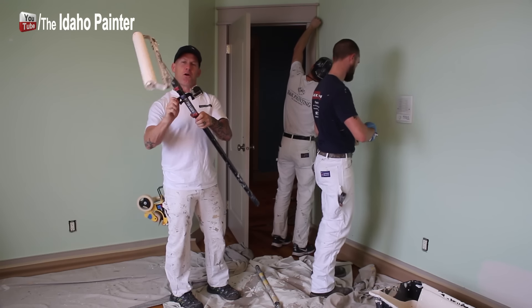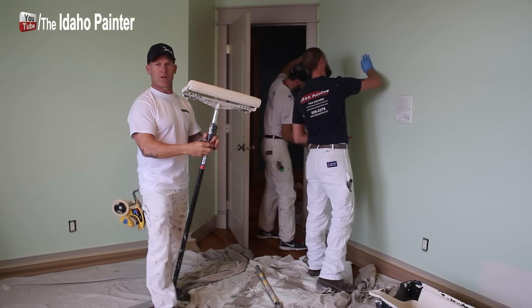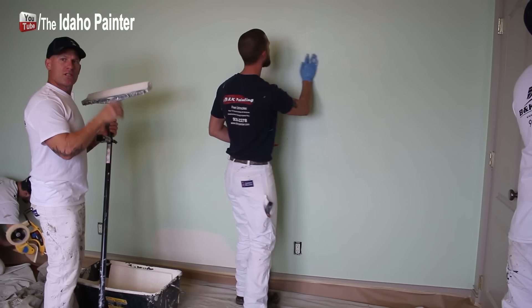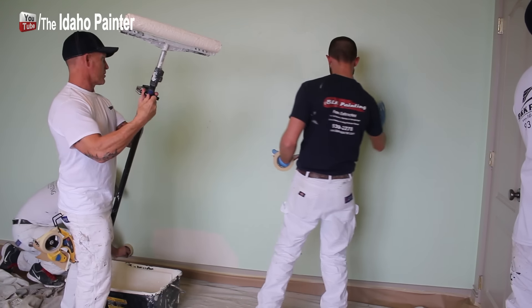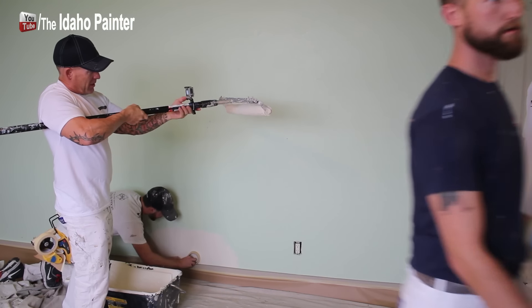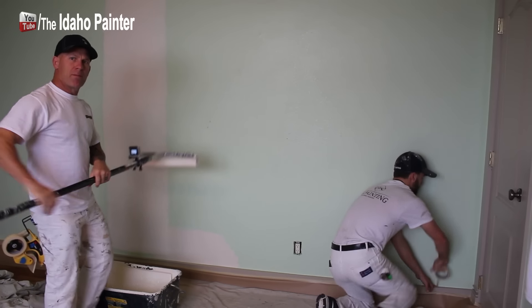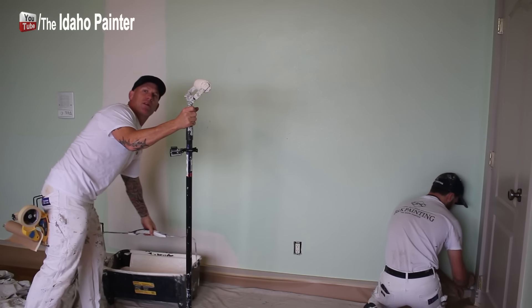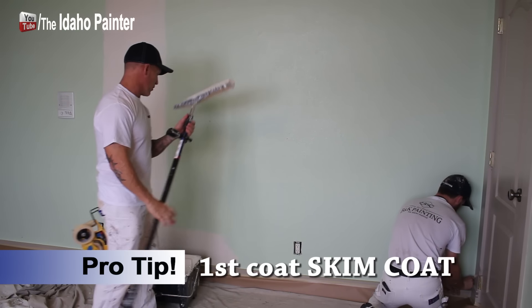GoPro cam is all set up right here, ready to go. We've got to roll up ceilings and walls in this room. There are some holes in the walls, and John's actually running around spackling the holes — we've got some nail holes and a little bit of spackling to do. This first coat of paint is going to be a thin skim coat. We want it to dry really fast. We've turned up the heat pretty high in here, which will aid in the drying process to help it dry really quick.